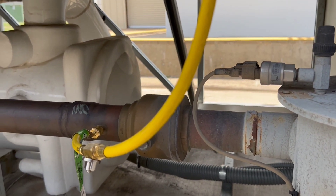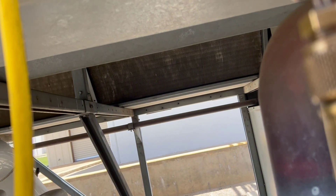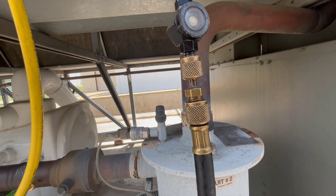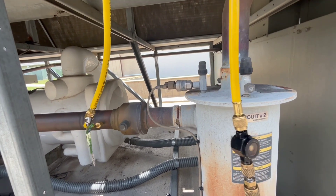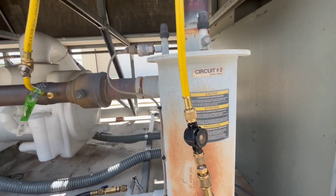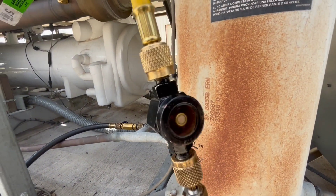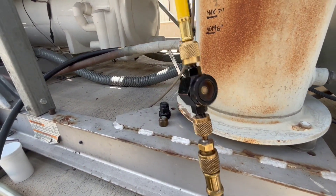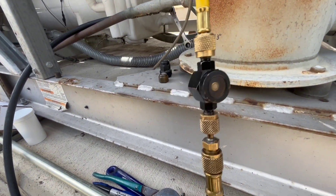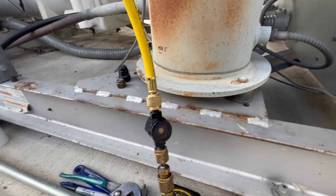If you're using the hoses like this, you have to keep the discharge hose up in a nice loop. Then what you do is you lower down the sight glass until you hit your level. It's not as easy to do with one hand, but we'll make it work. You can see the oil level filling up.